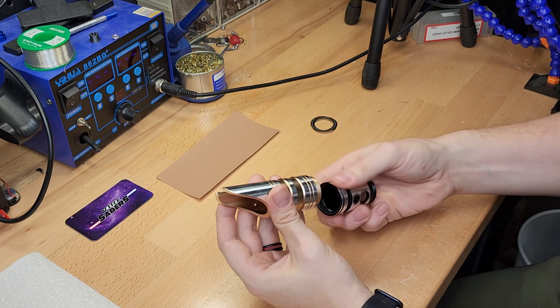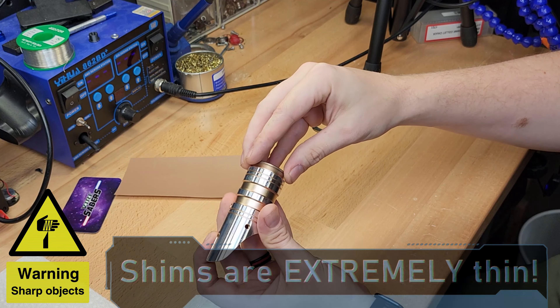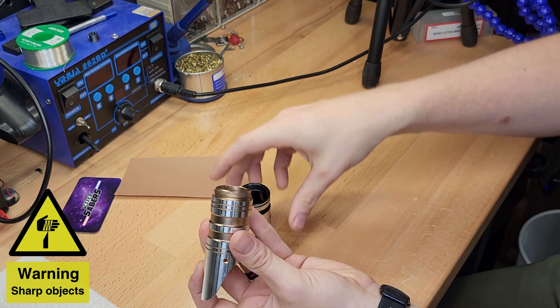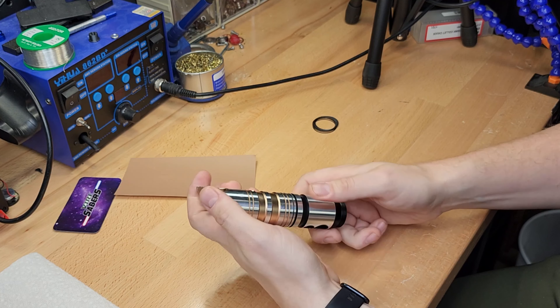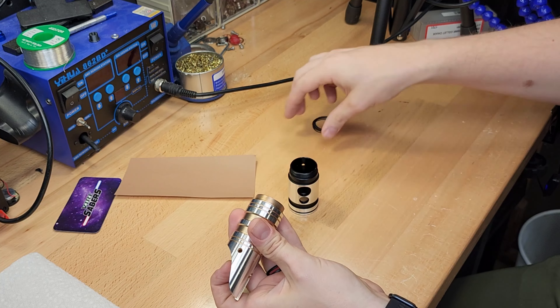The way to add material is to add timing shims. When you add a timing shim, that changes the location of this shoulder down here. You're adding material to it, therefore it's going to stop shorter as you thread it on. So I've added two timing shims onto this. As you can see I've still got a little bit more to go, so I'm going to add one more.